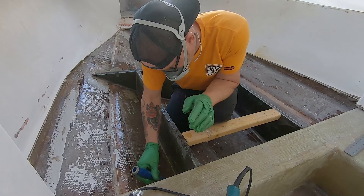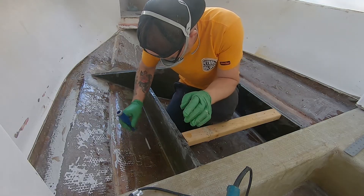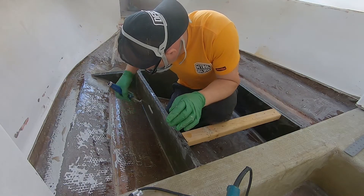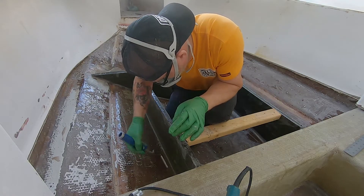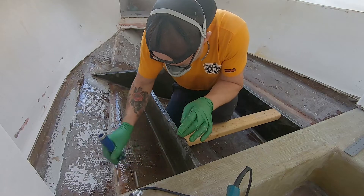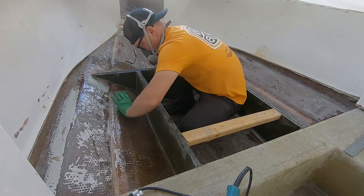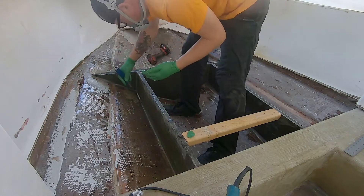The last step here is to grab the thin roller and come back to fine-tune everything I did by hand and with the larger wet-out brush. I'm just walking the glass from the radius outward, making sure as I pull the thin roller that I'm not pulling the glass out of the radius. You want that glass to stay firmly planted in that radius with no air bubbles around it, and just walk any excess resin and air bubbles out to the top. You can see why having multiple layers of gloves is a good idea — as the resin is kicking on my hands, my fingers start to stick together, so being able to pull those gloves off is very handy.